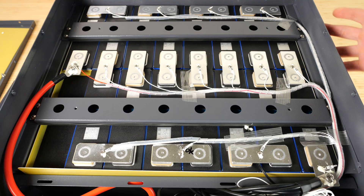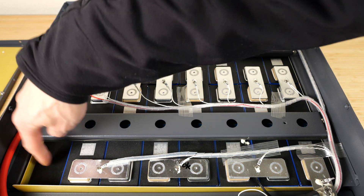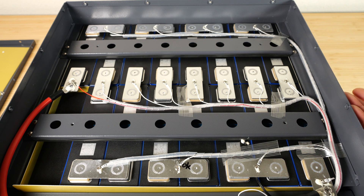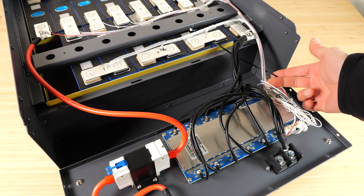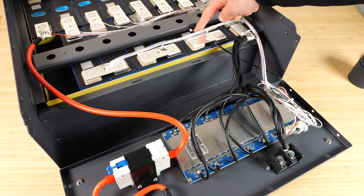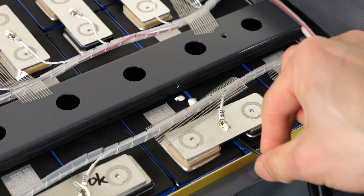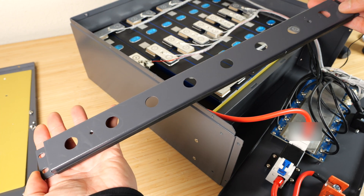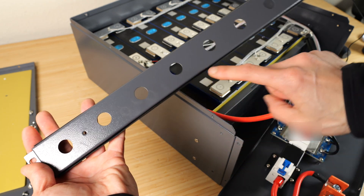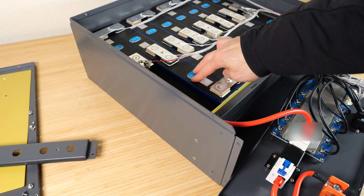There's fiberglass covering inside, and yes — 15 cells. Because these are welded in place, it would be difficult to just add another cell for a 16-string. There's an extra hole here that's just foam — it's a matter of energy density; you can't put a cell in that space. We can see a bi-metal temperature sensor, which can sense high and low temperature, but it's a little looser than I'd want. I do like how the metal hold-downs have rubber gaskets so they won't cut into the battery, and they have holes above all the vent holes so the batteries can vent if they get really hot instead of exploding.